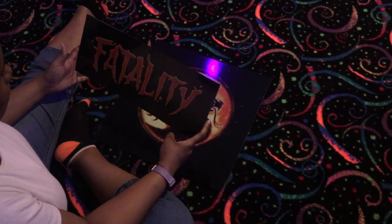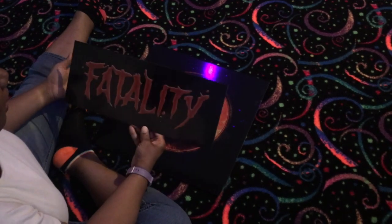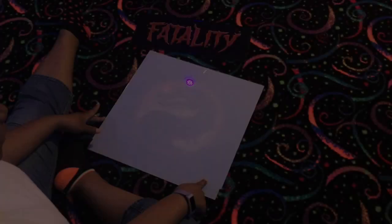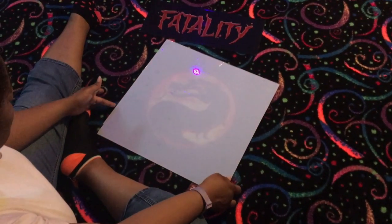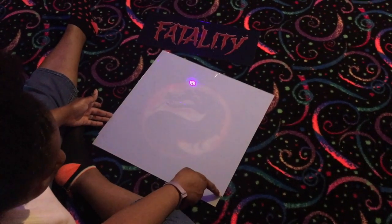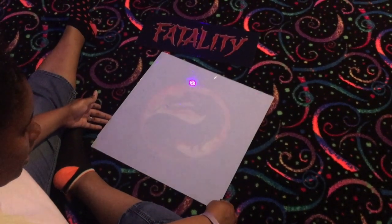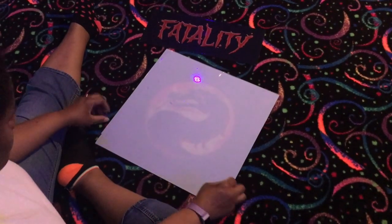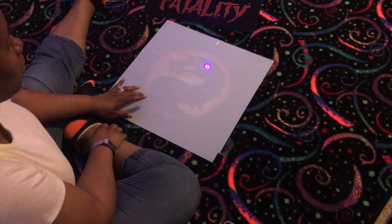And this is the J panel. What we did was take the original J panel insert provided by RK, run up to Lowe's, and they cut the Plexi to size. However, when you bring it back home, these notches you will have to cut yourself. What we did was tape it with masking tape before cutting. We also supported the Plexi so that it does not move while it's being cut, and we used a Plexiglass jigsaw blade. Purchase the Plexi from Lowe's — they will cut it for you for free.